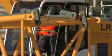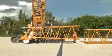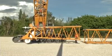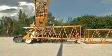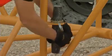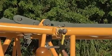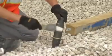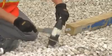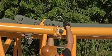Generally, the boom sections are always assembled in the same way. Here, this process is shown on the basis of boom head assembly. Position the boom head and pin the boom on the top boom connection lugs. The double tapered pins are delivered with the machine and stored on the boom sections. Ensure that the boom connection lugs are greased appropriately and always secure the pins with the washers and spring cotter pins delivered with the machine.